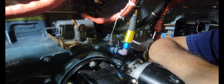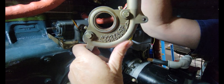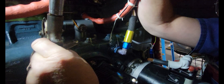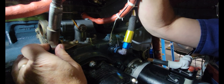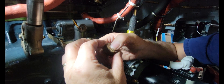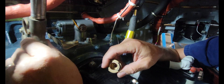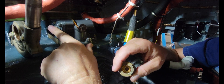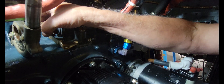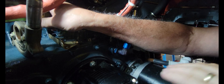Okay, now comes the fun part. This is what they call a Simmons drive, and this is what talks from the cockpit down to this valve to make it shift. You've got this little device that slips in here and it can move all kinds of ways — it's quite a unique thing. I'll figure out where we're at because this only turns about 30 degrees or so. I have to make sure that the cockpit lever is in the position for me to install that, so stand by.